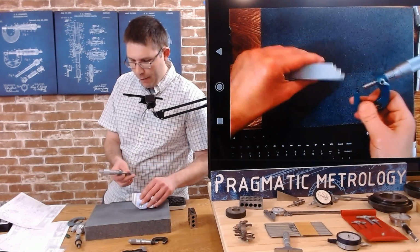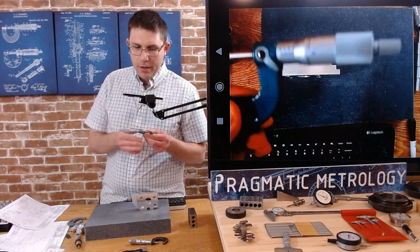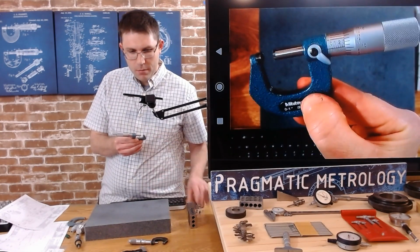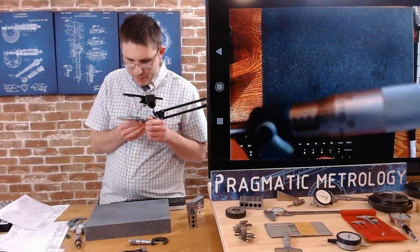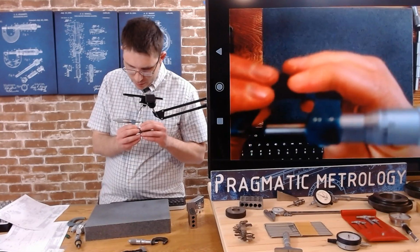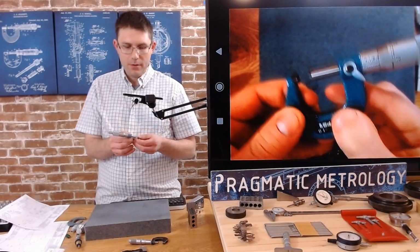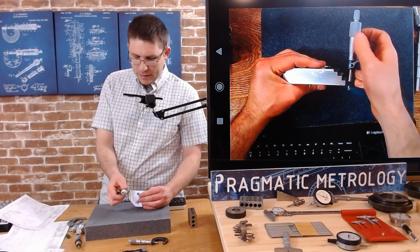I slide it off. We know we're supposed to be near 315 if this thing is in print correctly. And you're just about 310 and about 10 thousandths. Let's take a look. Yeah, 310 and 5/10 thousandths. So pretty easy to get this reading.